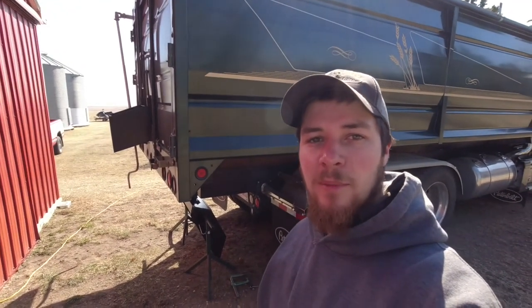So you see there, we got that hitch finished up. It was all painted, all welded up. I got the truck backed up in front of the shop here. We're gonna set it up on some stands and then get it in place and clamp it. And then we'll get the mag drill out and we'll drill through and put some bolts in there and hold that hitch in and it'll be done.